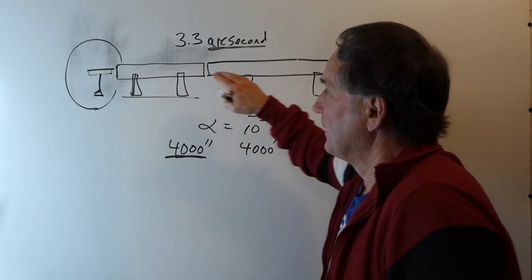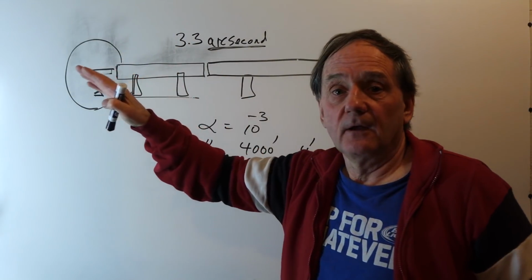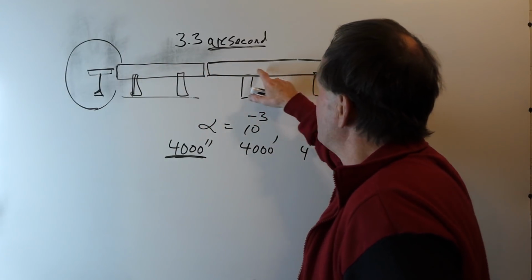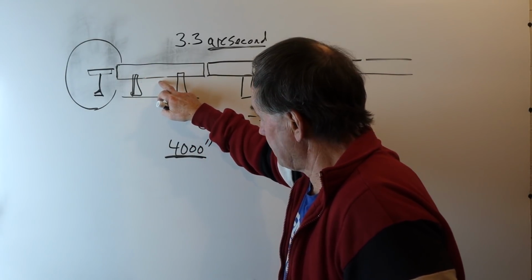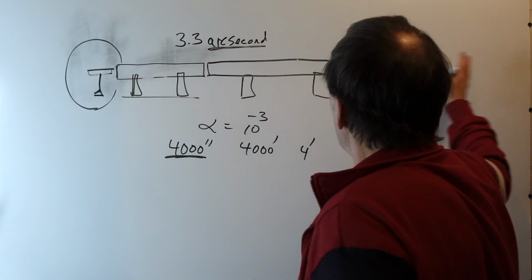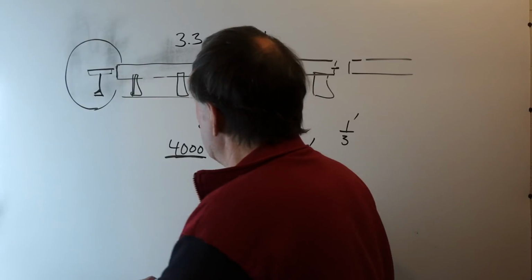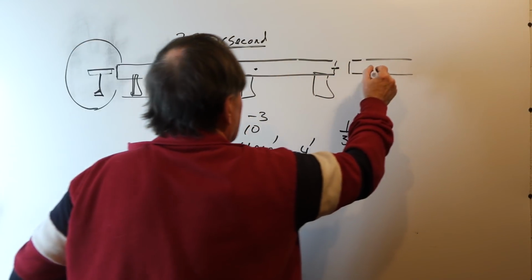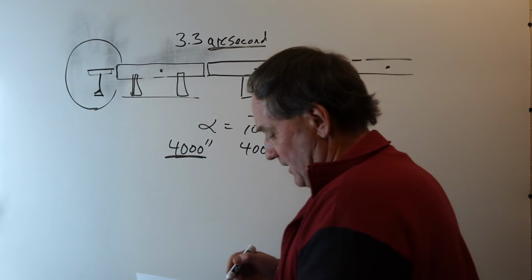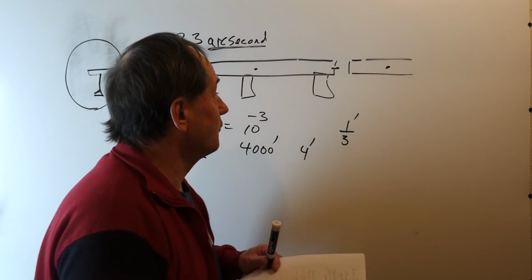Now, once this is all joined, you can eliminate refractive effects because you have a controlled environment inside the pipe. You're not outside like you would be with one of these beam fences or whatever and trying to sight things with a laser. You could very easily control the temperature inside here by maybe having a fan blowing down this tube. You could open up the tube and mount a fan in here and get air blown down here to keep the environment stable and constant. You could mount thermistors, say in every tube or every few sections of tube, to monitor the temperature, so you can measure the temperature profile going down the tube sections, so that you could calculate whether or not there is any refraction.